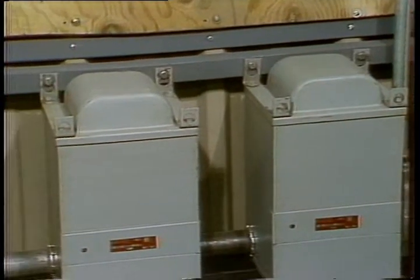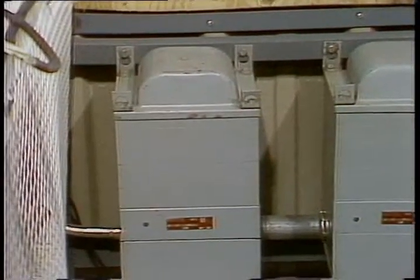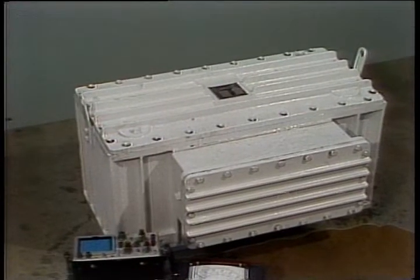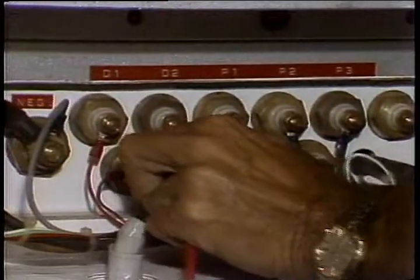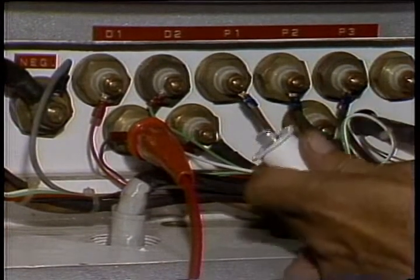If the AC supply cables from the power transformers were hooked up improperly, you may have improper phase rotation. This can cause the controls to malfunction. In fact, it may cause severe damage in the control box. For this reason, always check the AC input with a phase rotation meter after hooking up the controls. This should be done every time a land rig is moved.